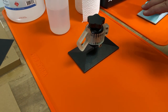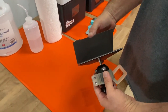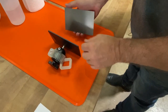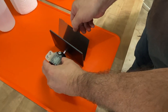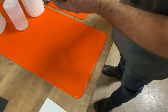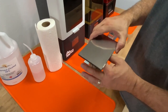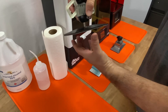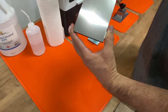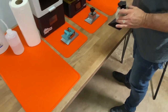After the 72-hour cure, we're going to put it to use. We don't want to test it with our flexi plate right now and risk pulling it up and ruining the adhesive bond. For lining up the flexi plate, I get the magnet and the build head down on a level surface, line up the bottom and one side, and let it go. Be careful if you're wearing rubber gloves — it can pinch the rubber underneath and leave it a little off center. If you need to adjust the flexi plate, do it from the bottom while the build head is set down flat.